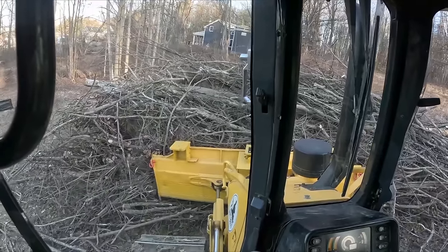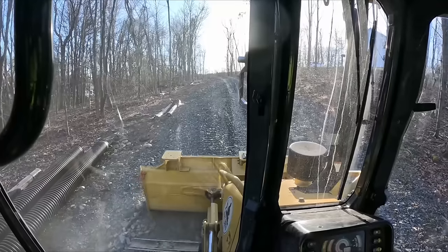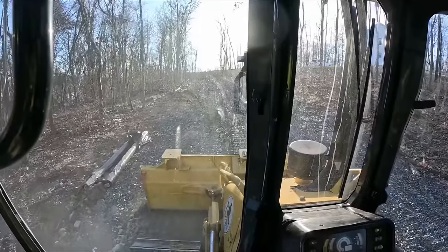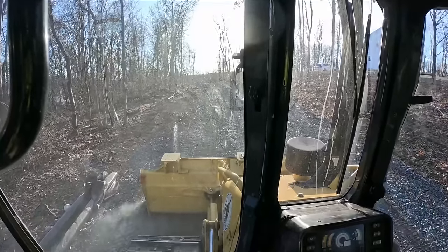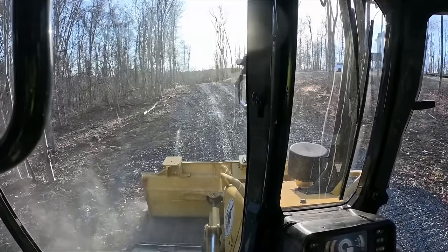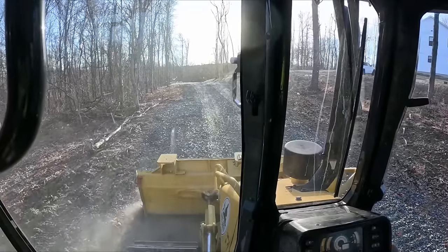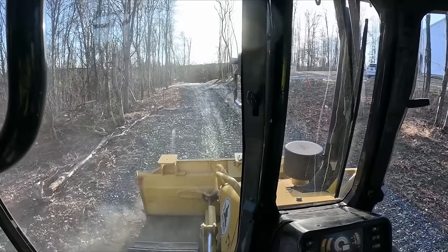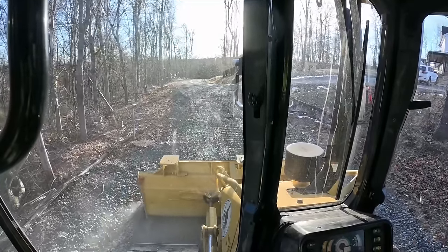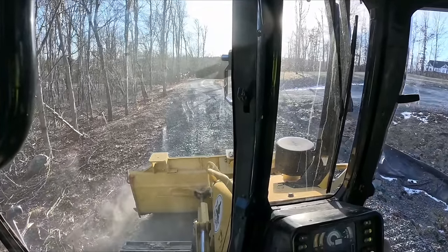Just pushing back to crush. It's gonna be in my swale. Up on top, it's gonna have to be built up. It's kind of not ideal the way this is set up, but nothing we can do about it right now. It is what it is, because we got an existing house to the right. We got a match. We can't cut his driveway down, so we actually got to come up. Right where that driveway to the right goes up, I'd like to cut this down to get this driveway down, but then it's going to create this issue going up to his driveway. It's going to create a weird transition. So it's going to have a roller right here. It's going to come up in the air. We got a sewer manhole right to the left.